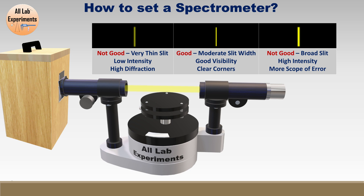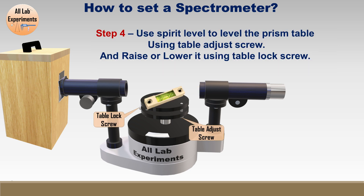There are three possibilities. When the slit width is very low, you will get a low intensity but high diffraction, giving you a blurred image. If you open the slit a little bit, you will find a good, clear image of the slit. In the case of a broader slit, chances of error increase, intensity is high, and there may be multiple unnecessary reflections within the system. So the slit shown in the middle is the best one.